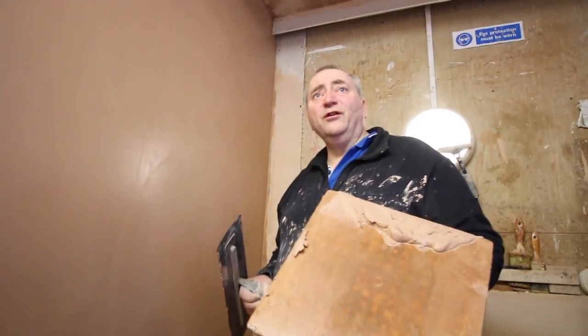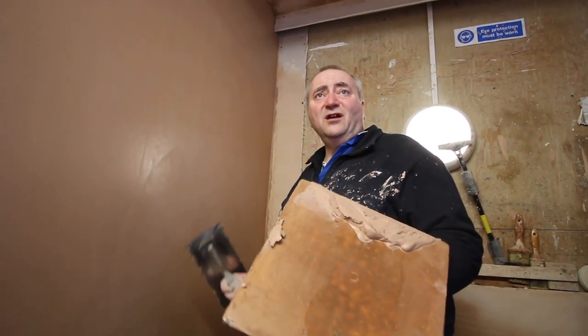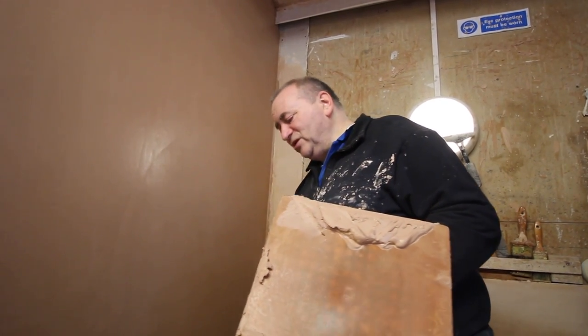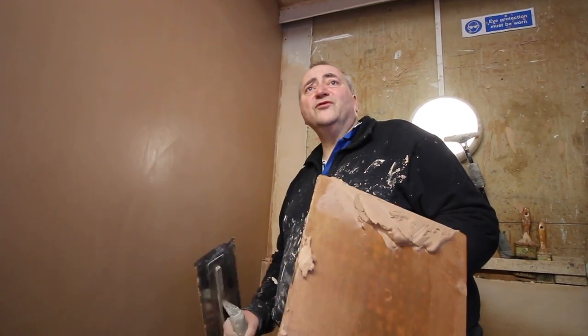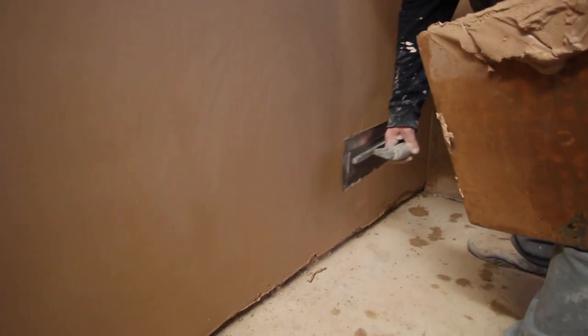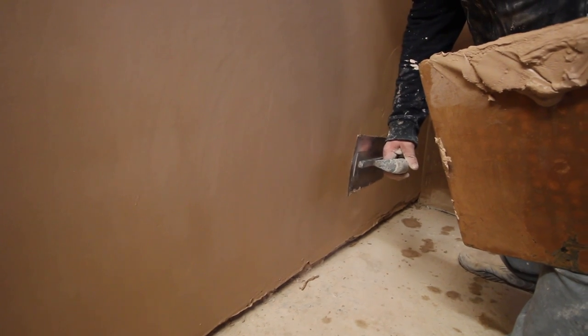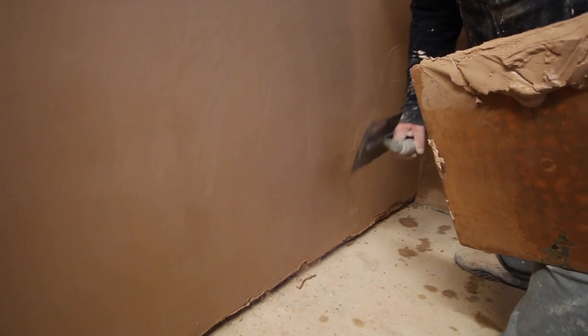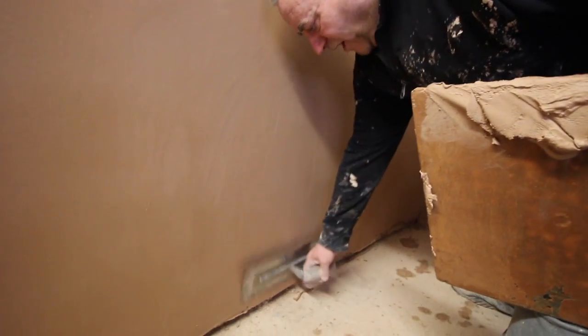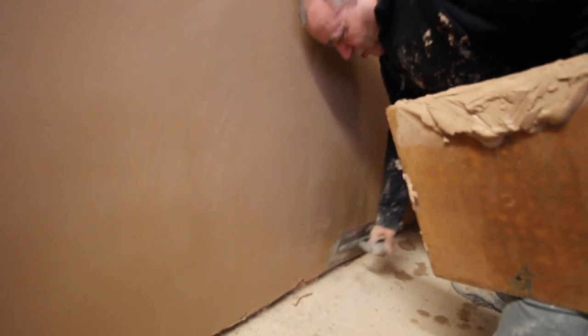And you'd never plaster directly right to the floor, unless you know you're in a room that's to get done straight down, because nine times out of ten, skirting goes on and covers the bottom three or four inches. So you've just got to make sure you're an inch and a half off the ground, something like that, nice and smooth above that. And as you keep the bit underneath it, you just need to keep that flat. So the joiner gets the skirting on flat along the wall.